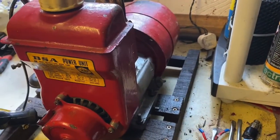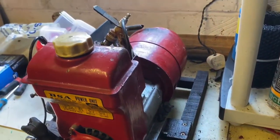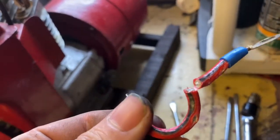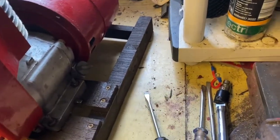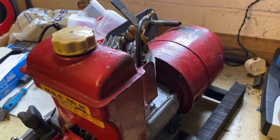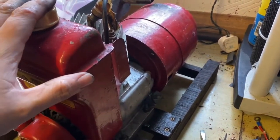It's designed to charge batteries at a high rate. It hasn't run for years and we haven't got a spark at the moment, so we're going to have to take all the cowling off and get the flywheel off to get to the points. The set did used to have electric start, but we can't use that — some of the wiring inside has completely melted away. That wire was supposedly designed to take about 30 amps but clearly hasn't been up to the job. We'll need new wiring, but with everything shut we can't just nip out and get cable, so no electric start for this video.